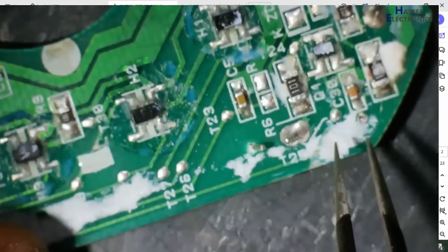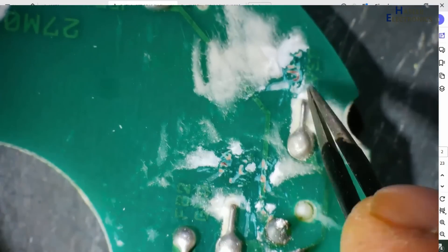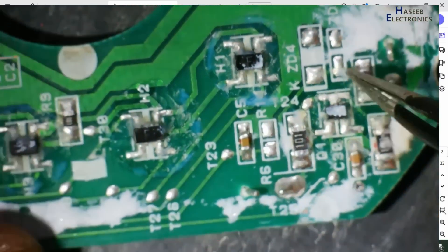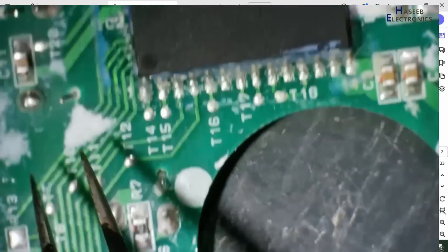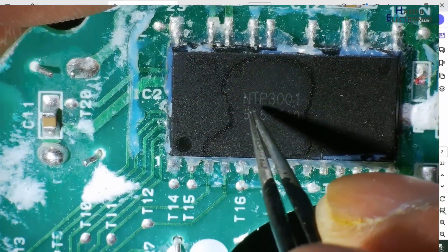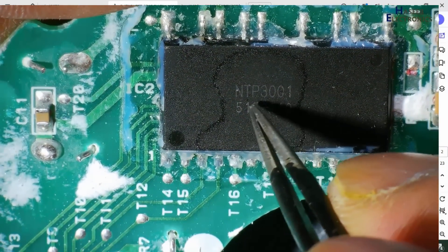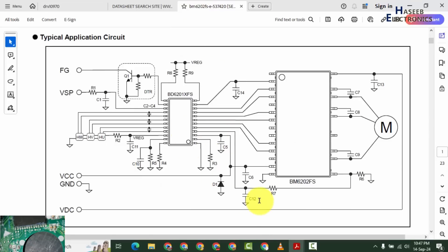Here is the pinout. We apply the control signal — the VSP signal — and it will reach to this resistor. This signal will reach to this IC, which will provide the drive signal to the IPM NTP3001. When we search the datasheet for NTP3001, we cannot find any supporting document for this IC.